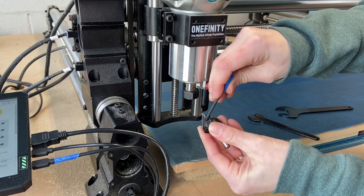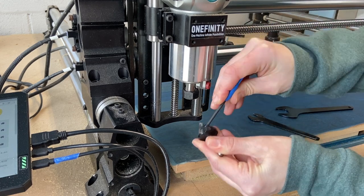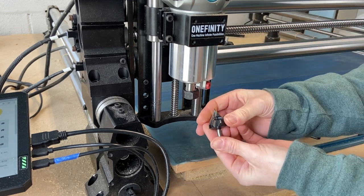Number four: if you're using a bit with a removable knife, please double-check the tightness of the knife in the bit before you get going. I've used a bit like this before and it actually shattered on me mid-job. I didn't get injured — the shrapnel went to the back corner of my shop, thankfully — but from now on I always double-check the knife tightness in that bit.